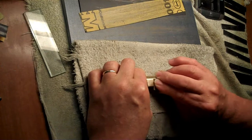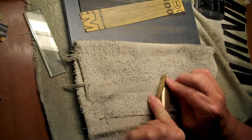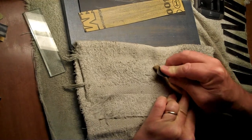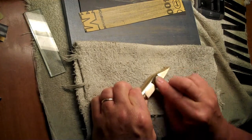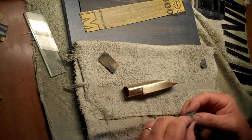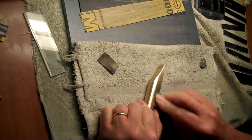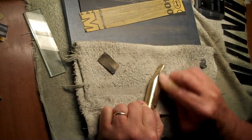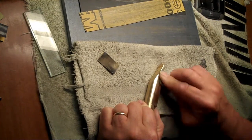So that's the finest sandpaper I use when I reface. Some people go finer, but I haven't found a need to. After I see nothing but sanding marks from this sandpaper, I switch to 4-0 steel wool. I may even go over the entire piece with this, but it doesn't really need it. Like I said, he's going to buff it.